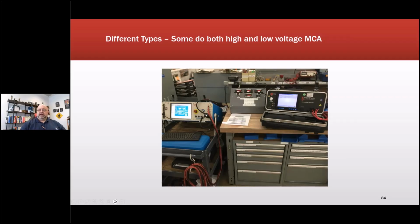This one we won't. The other day I did a demonstration. We videoed it because I was showing my intern some of the tests we do, and I brought in a stator, and I had a defect in the stator that would glow. So we turned it on, we started it up, and I was just looking for the partial discharge glow and have it trip. Nope, it blew right through that, and not only did it blow through that, we had multiple faults at different spots, and then it started running the next phase. So have to be very, very careful with these.